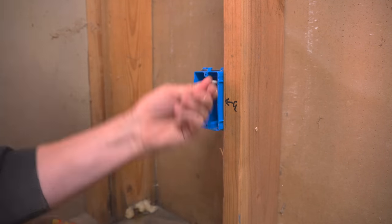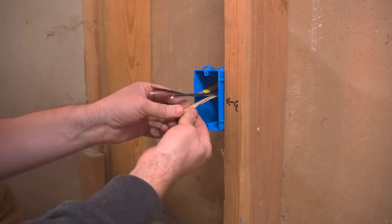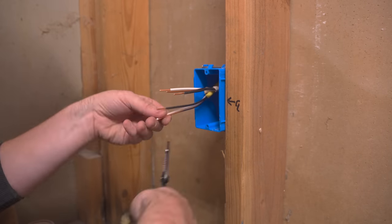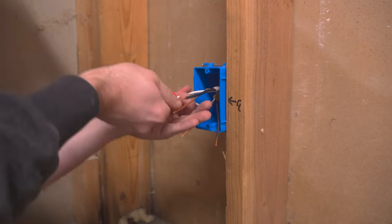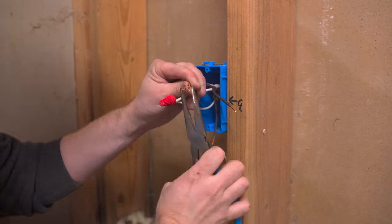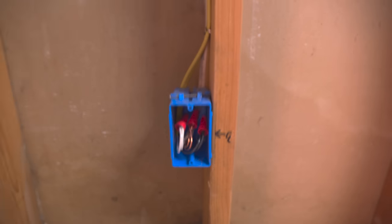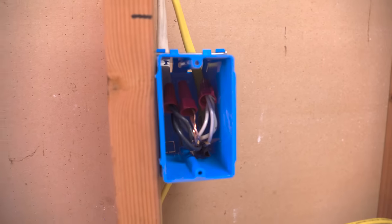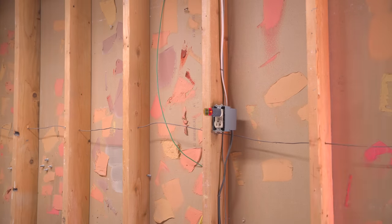It's super nice to be able to lay out your own outlets. I did this in my workshop, and it's been really, really nice to do. It's one of the first things that I start with, figuring out where I want all of my plugged-in devices and then setting up the layout for electrical, because if you don't do it at this stage, it's really hard to do later. The left wall was pretty straightforward. I was able to get three new outlets in and connect back into the original power. The right wall, however, was a little more complicated.